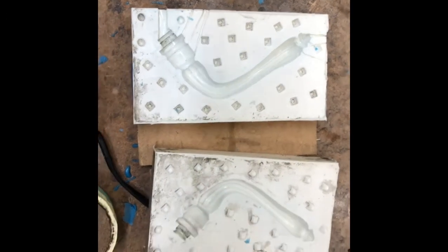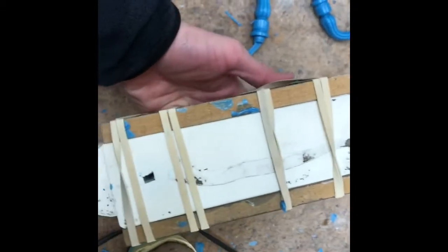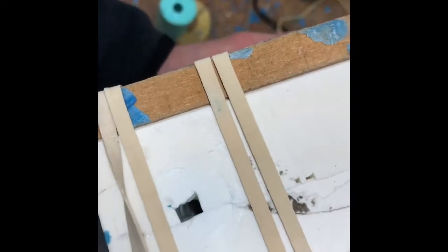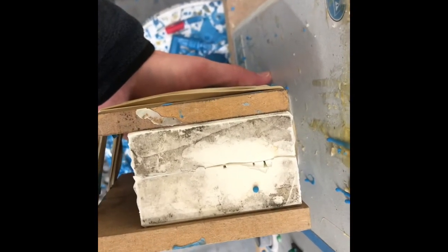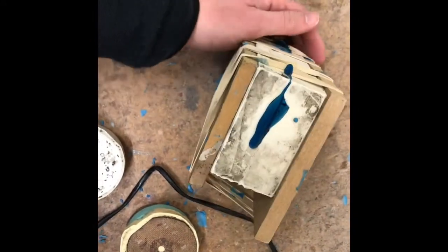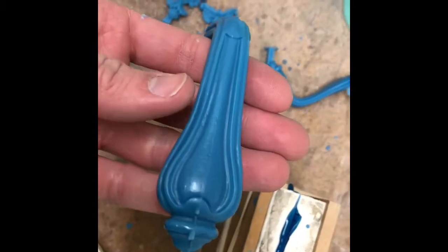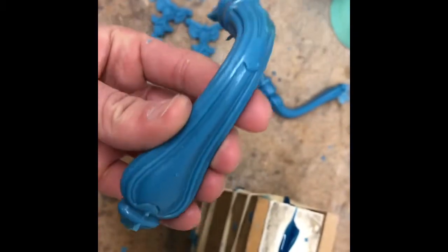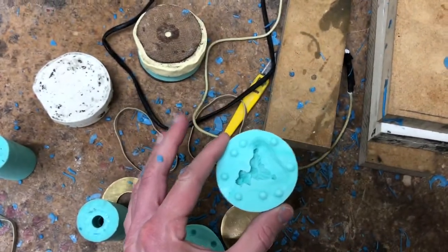Here we have the molds — as you can see it has a handle door handle pattern inside. I'll make sure I put boards and rubber bands around the mold because when I'm pouring wax into it, it's possible it will leak out the sides, which is what we don't want. I apply the mold to the wax injector — there are a couple of vents at the top, so once wax comes out the top that tells me the pattern is fulfilled with wax. I lay it down and let it cool and set for about five minutes, and then the pattern will come out — as you can see it's a detailed door handle.